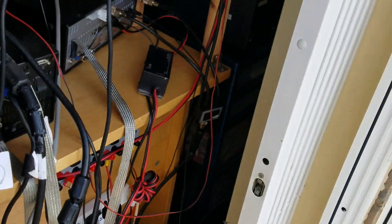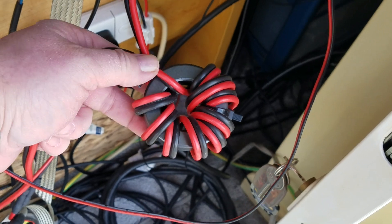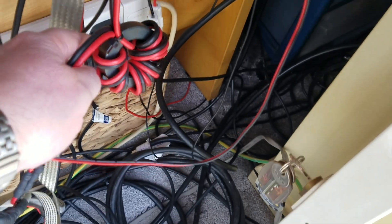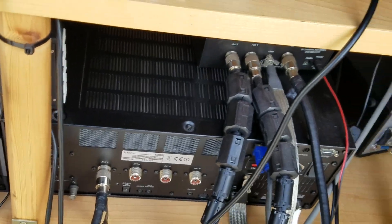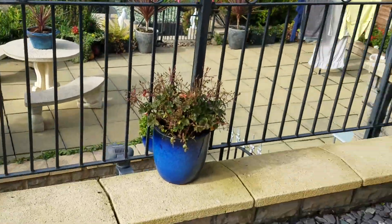I didn't show you the 12-volt lines - on all the radios I put the toroid cores on to try and suppress noise. I've just seen them on the Palomar kits and done it myself. I've certainly noticed some difference in noise in the shack.